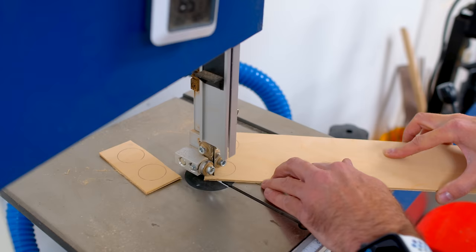Always get the screw started first. That slides along there with no wiggle. We're going to attach another board that's going to go on right here — just glue and screw it just like before. You do want to make sure it's square; it should be if you're using plywood. Now we need to cut two little runners that are going to hold the picture frame in place. On one end of each piece I'm going to cut a 45 — not 100% necessary. Woodworkers love overkill.